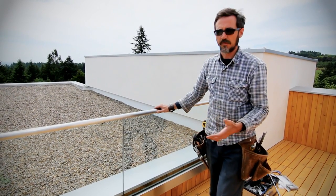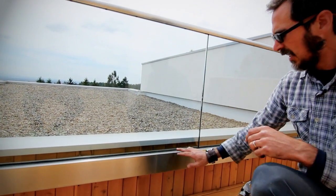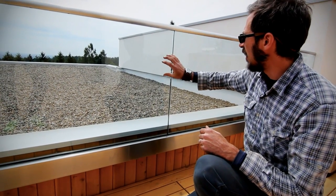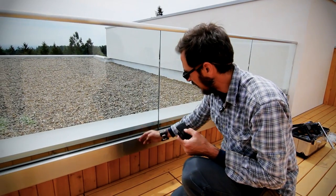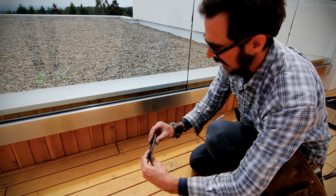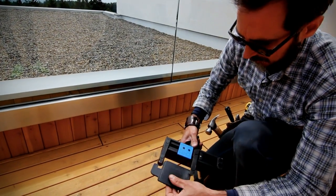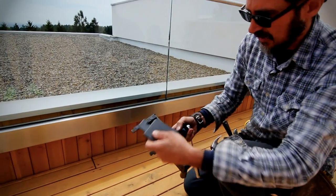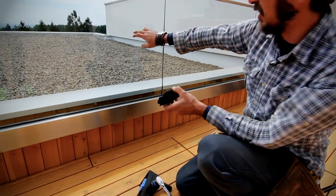You order everything in stock lengths, then cut and fit and put them all together. What you can't see underneath is there's a big U-shaped aluminum extrusion bolted onto the wall. We took measurements for the half-inch tempered glass that fits in there. The glass drops down and fits into the shoe, then little shims slide down in and lock the glass in place. You buy a tool kit from CR Lawrence — it drops into the C-channel, you ratchet it, and it has a built-in stop that pinches the shims and clicks the glass into secure position.